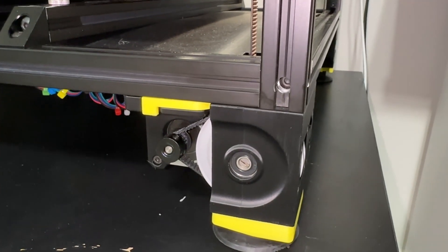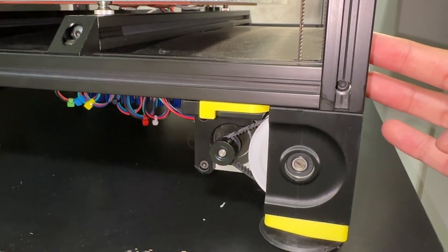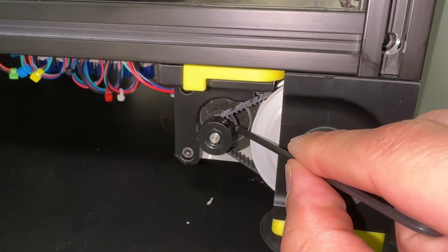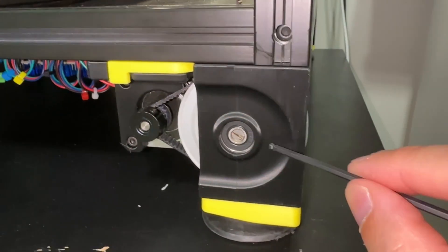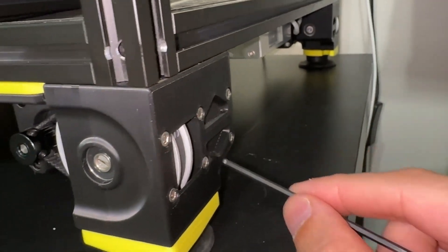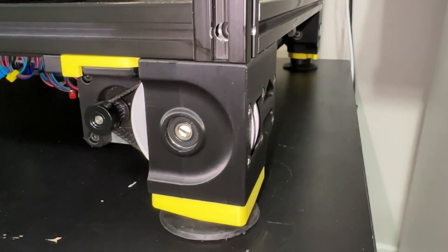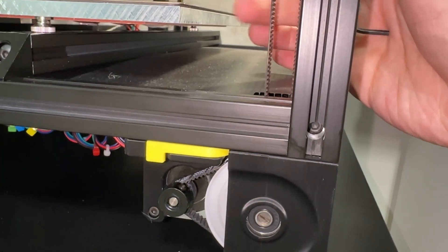The sixth video was assembling rails, panels, Z drives, and heat sets. Hands down, the biggest mistake is not grinding flats on the drive pins or using thread locker on set screws. Here is the Z drive — now would be a horrible time to find out a pulley is slipping due to a loose set screw. Note I did not specify which pulley because there are three, so hopefully it's not the two inside the drive. Even worse, if it's partially loose, the printer partially works, making it harder to identify the root cause.